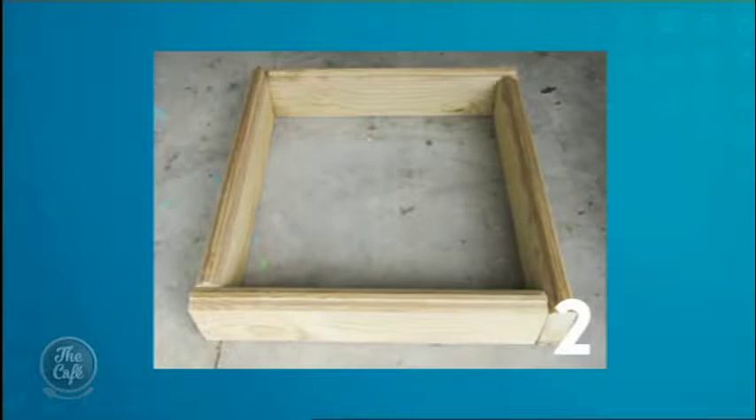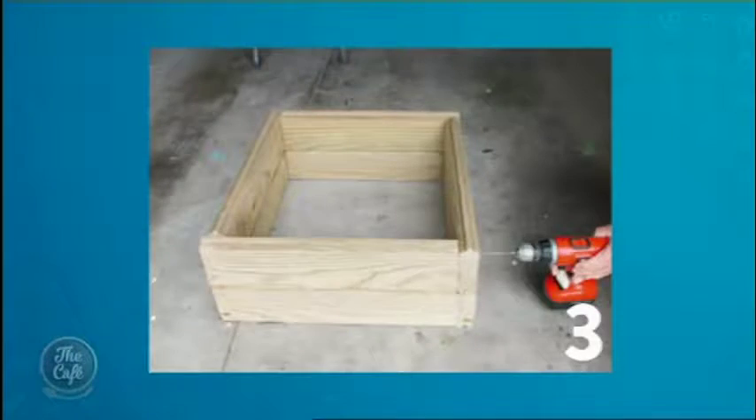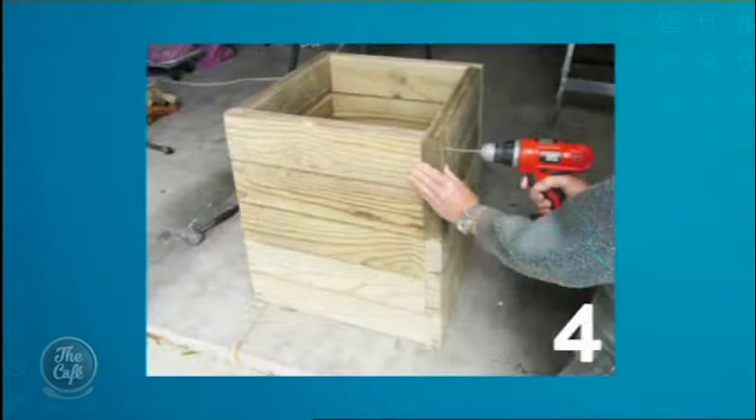Step two: do the sides — it's got four sides. They obviously need to be the same size as the base, but you can make the box as big or as small as you want. You screw them at the sides, and with the tongue-and-groove retaining timber you slot it in on top and grow your levels of sides to however high you want the box to be. The reason you use screws rather than nails is because you'll plant something in there, the roots will grow, and if it's something quite big they'll start to push the sides of the box out. Screwing holds it together better.